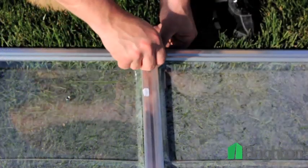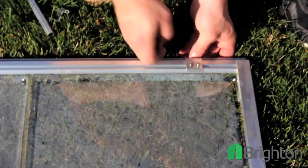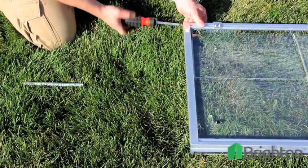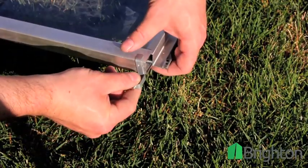Now attach the T-bracket in both hinges. Leave the hinges loose so they can be lined up when installing the door. Screw on the lower bracket of the door. When screwing on the bracket side, include the latch magnet. Make sure the magnet is facing the front of the door.